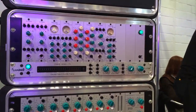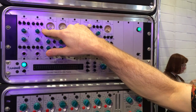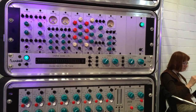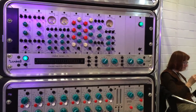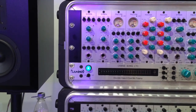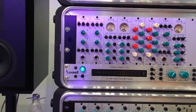The preamp is a two-stage thing. There's a pad on the input, and the overload lights light about 6 dB below clipping. So if it flashes a little bit, you're starting to push the tube and getting more color out of it. With a little bit of use it becomes easy to judge your level. You can also turn the output down and the input up and do overdrive kind of things — guitar distortion, drum distortion, that sort of thing.